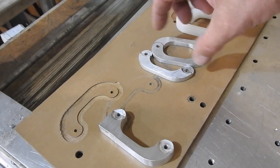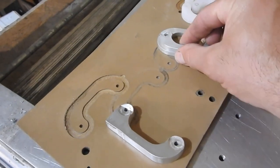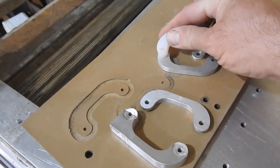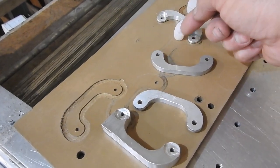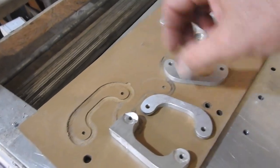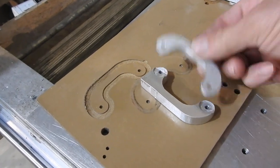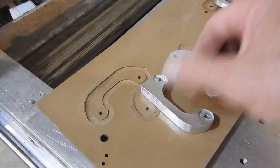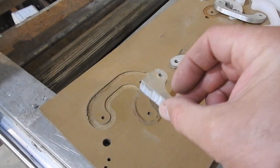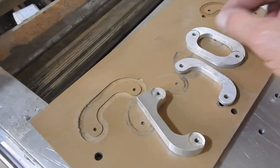When I made the new pieces and put the bearings in them, the cam wouldn't fit — the bearings were just a little too close together. So I had to make some new ones that are slightly longer. I also made these parts wider so the cam would ride on them properly, because the cam was catching on the edge. There are six of these total, three per side, and you get two of them that come together on each side like so.